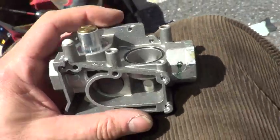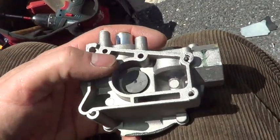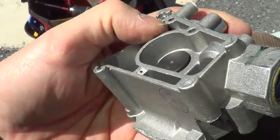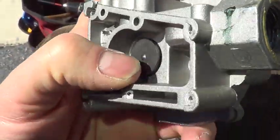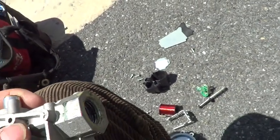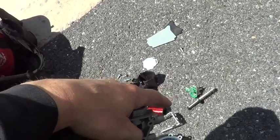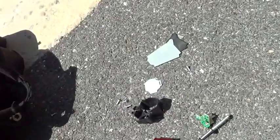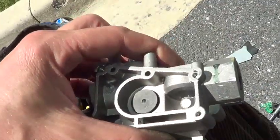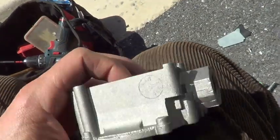These are designed so that when they fail, they fail to a safe position — it's called fail-safe. Anything dangerous is designed like that, especially with fire. So if one plunger gets stuck, this valve is going to fail to off. You'd have to have both plungers get stuck open, which is unlikely, for this valve to fail to on and cause runaway flames and burn down the house.